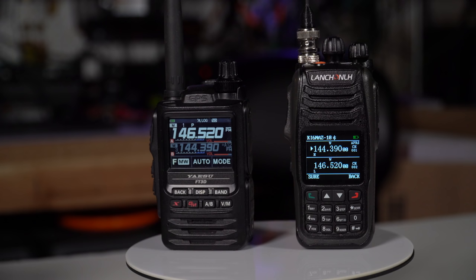That's the first major caveat: beaconing out of the box works. You program your call sign in and you can start sending out APRS packets, and it is GPS enabled so you get a good lock on where you're at when you're outside. It also has a digipeater capability, and yes, the digipeater capability works. Using my FT3DR on WIDE1, meaning I'm transmitting out of that radio on WIDE1, this picks it up and will boost that out over WIDE2. Why you would want to digipeat on a handheld at five watts, I don't really know — some of you will tell me a good reason.